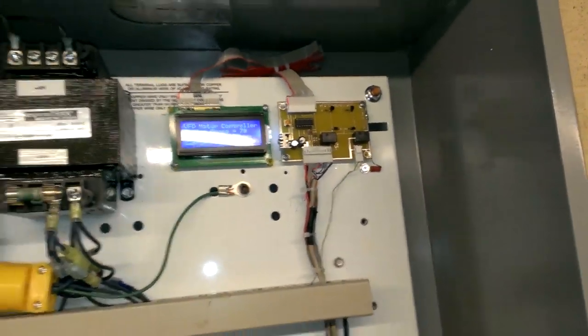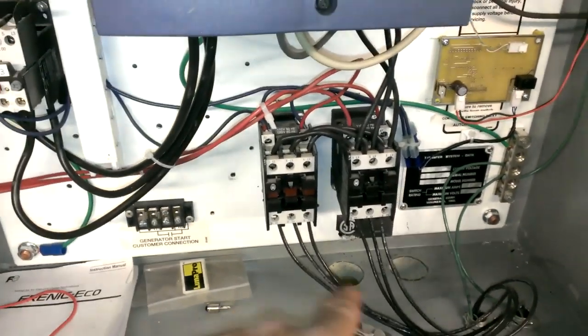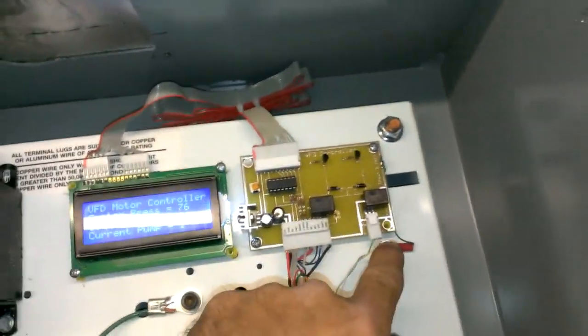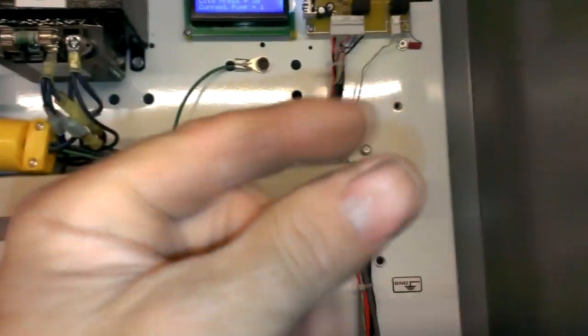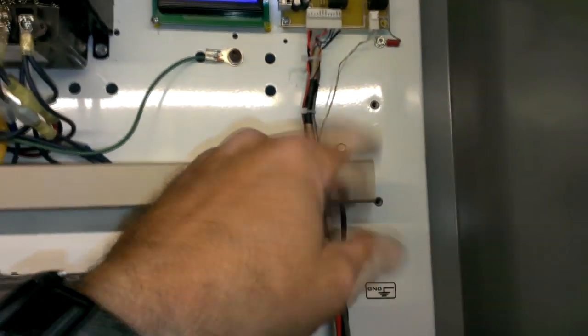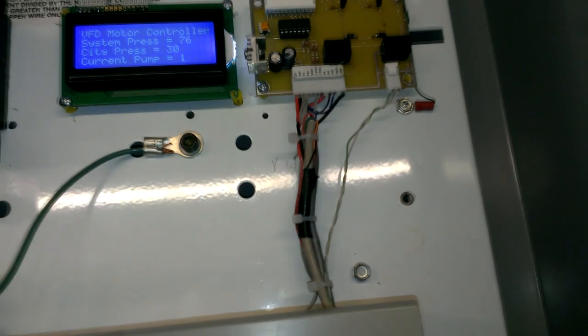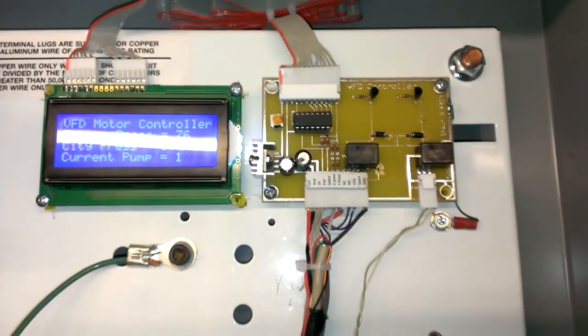The only other issue I did have though was — see how I made that — this is supposed to be the high voltage relay to switch the 120 volts to the contactor. I was supposed to switch the 120 volt contactors through that little relay right here. But I still was getting interference. Must be the relays that I chose for my design. When the contact opens, I get some sort of spike induced across the coil windings somehow, and it spazzes out my VFD, makes it restart. I had issues with it before — that's why I had to make that little relay board down here to stop doing that.